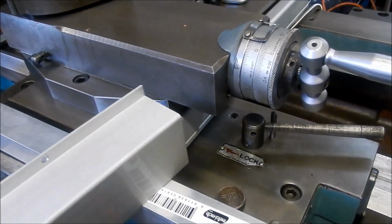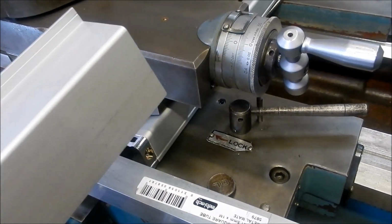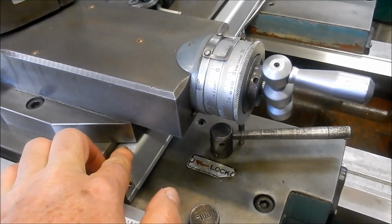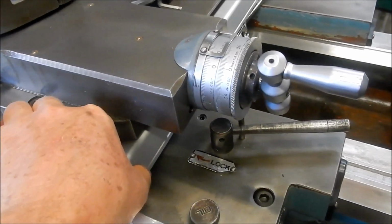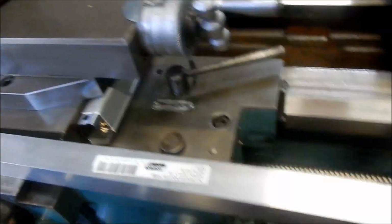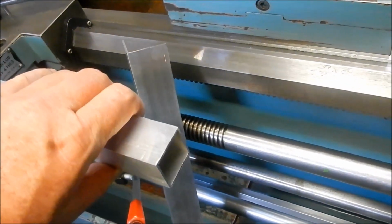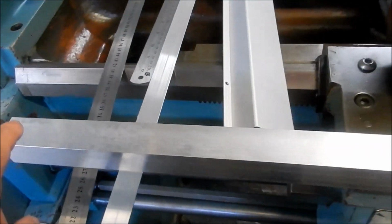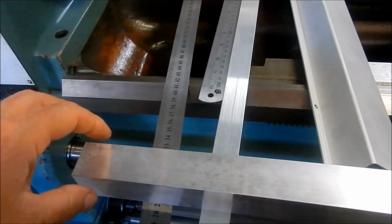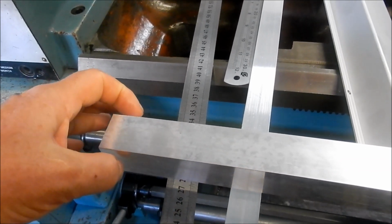As I mentioned, you do get some covers, but it's miles too big. Even if I don't think I could really rework that to fit into that very tight spot. And I do have some constraints here that I need to work with on this. And one is the distance that I've got between the top of the glass scales and the underside of the top side. There's not a lot of room there to work. So I'm going to be using a bit of 1.6, 30 by 30 square hollow section aluminium, and the plan is that I'm going to create a window or a cutout inside here that the DRO can fit down inside. I'll keep the ends enclosed, and I'm going to fit an angle over here as an enclosure as well, give me a little bit of extra packing.